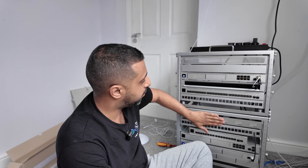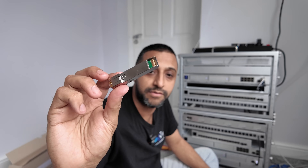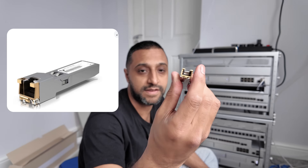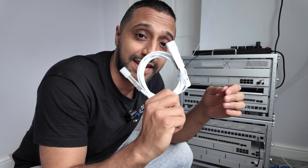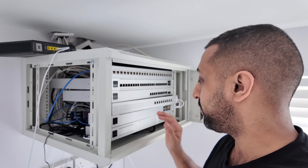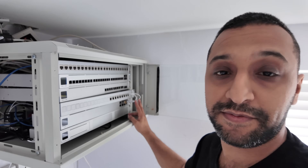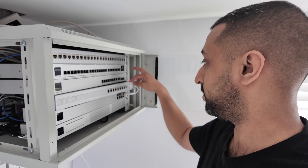In terms of other accessories we have the AI port rack mount, patch panels and OCD panels at the top. To connect the UDM Pro Max to the aggregation switch we need an uplink cable - this one is three meters in length going from here all the way up. I've plugged SFP plus ports from down below into the aggregation switch and just need to go from the aggregation switch to the two switches here, then pop in the patch cables and we're good to go.